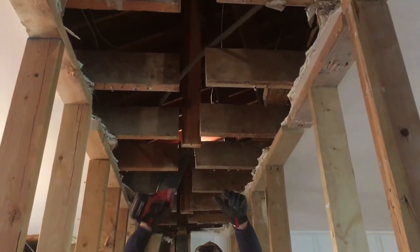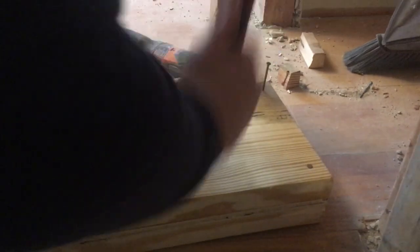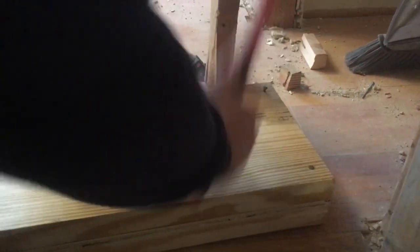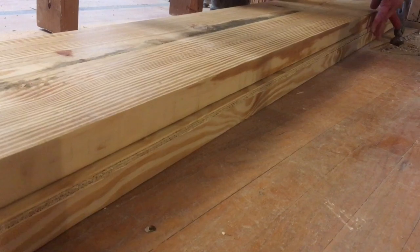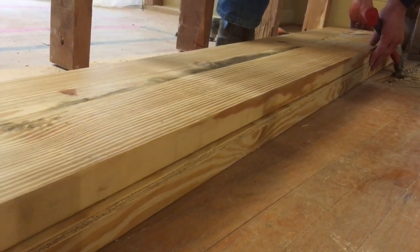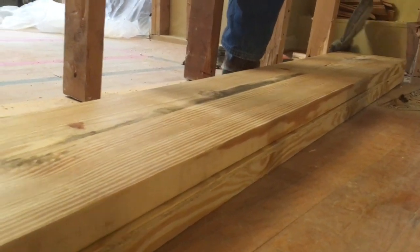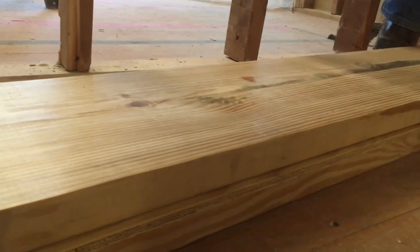You can see here we've trimmed them all away. All these 2x6s are basically just holding up plaster and drywall — they're not really structurally load-bearing — but we're still building this as if they were. Here's our new header: it is 2x12x16. We're tying 2 of them together with a little piece of plywood in between them because that is up to code for our space — it had to be a little bit wider.